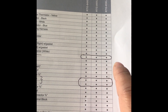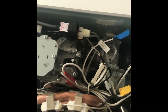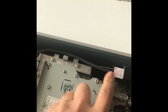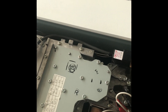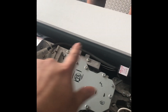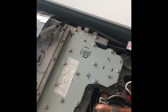Even Home Depot carries some of these parts. I have a demo unit available — after the Texas storm, several neighbors replaced their units and one is readily available for parts. The igniter coil is currently back-ordered for another 10 days, so to help out my neighbor I'm pulling the coil from this demo unit and installing it in the neighbor's unit.